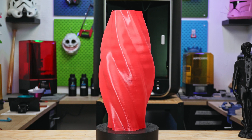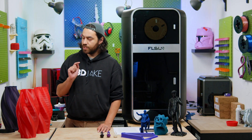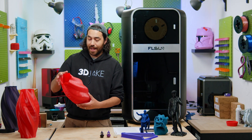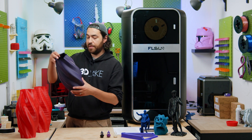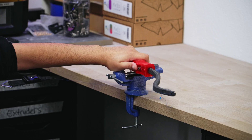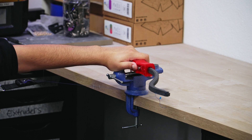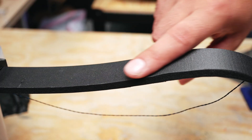The best thing about printing with these filaments is that we are not so restricted by part cooling. I was printing this with 100% part cooling. One thing I did notice with these prints was that if you look closely, you can see a considerable amount of salmon skin. I printed this at varying speeds and varying temperatures — this one is a little more glossy than the one printed slower. I also printed it in PLA — this is PolyTerra Army Purple — and it is also noticeable. But with other prints, I didn't notice the salmon skin as much. For those wondering how well it can print tougher materials like nylon, we tried to make our own bow and a lot of those nylon carbon fiber parts were printed on the S1. I am very happy with how these turned out.